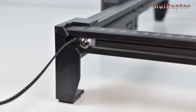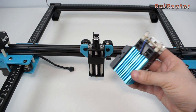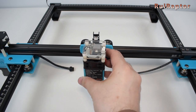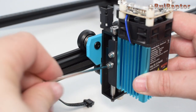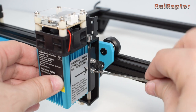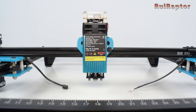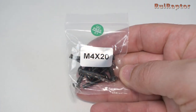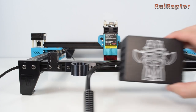It's also possible to adjust the tension on the two Y-axis belts. But to do that, you need to loosen the screws that secure the belt and adjust. Next is the laser module. We need to secure it on the X-axis carriage using the M3 by 8 screws, two on each side. Make sure the laser module is squared with the structure while installing it. The shield can be placed now under the laser module. Next, we use some more M4 by 20 screws to install on the front profile: a cable restrainer, the focus tool mount, and the controller.